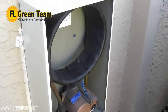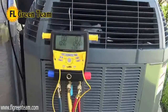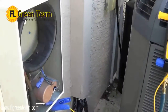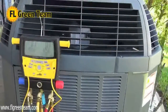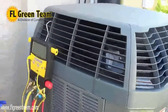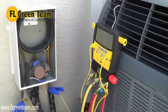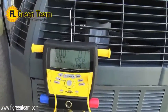Mr. Villaverde has five occupants in the house. All five people are using this heat recovery to heat all their water, because, as we will show you later, his water heater breaker is completely turned off. On this Trane XL20i with SEER efficiencies up to 20 and the heat recovery from Doucette Industries, we can heat water for a total of five people — even at the end of September, at the end of the summer months — and still have plenty of hot water for the family.